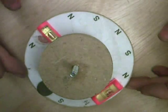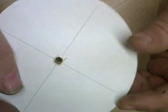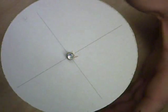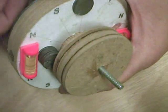I've been asked how I balance my flywheels. Very primitive, I'm afraid — nothing spectacular. It's the sort of thing that you would have for balancing a car wheel, but a small version of it. All I do is stick my flywheel shaft through, then balance it by drilling holes in certain places and adding lead or magnets where it needs to be. That's basically all it is, so that's how I balance them — balancing the rotor. Just a cheap, simple method that works every single time. I hope that helps.